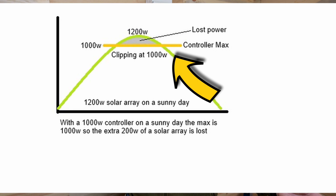The reason for that is, on peak solar days, you're going to be able to get all the power that your charge controllers can take and your array can provide. If you overpanel instead, you're going to be losing power on those peak solar days. For me, peak solar is in the middle of summer — it's when I can use more power. I don't want to clip off extra power when I'm trying to run an air conditioner. I want to get peak power when the sun is perfect. If I need more power, I'm going to add a second charge controller — like the Victron I bought for my cabin, upgrading from a 600-watt to a 1,200-watt array.